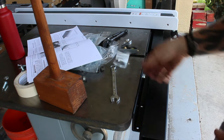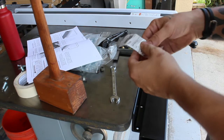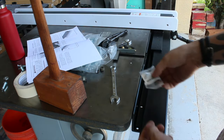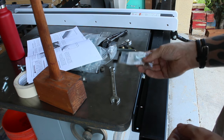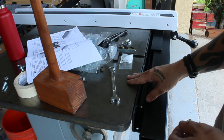Update: the rails went on pretty easily, no problem — that's the only good thing. This Unisaw actually uses 3/8 inch, 1 inch long, 24 TPI bolts. That was not included in the kit, so I had to make a run to the hardware store. I bought four of those and a couple of nuts for this side, and I think it cost me under $2 for that.